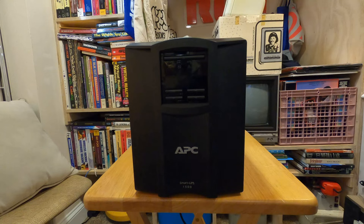It's important to note that this is an SMT 1500 and not a 1500C. The C models are their cloud-first platform. I'll show you the back in a second, but all of their UPSs seem to offer a console port as well as a USB port for monitoring. Their cloud models have an Ethernet jack specifically for interfacing with their cloud platform, but this one has the ability to plug into your LAN and be accessed through your LAN. I'd rather have more functionality than be locked into some weird service.